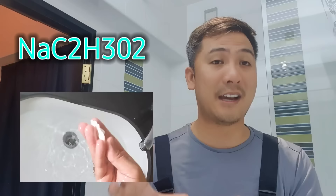So as you can see, vinegar and baking soda does not work. Sodium bicarbonate — which is baking soda — and vinegar, which is acetic acid, form something called sodium acetate. It is water soluble but it also forms these crystals inside your pipes which may worsen the clog. Go and get yourself a chemical solution, a drain declogger from the supermarket — that would work much better. But if that doesn't work, you have to open up your pipes. Click up here for that video — I'll teach you how to open your pipes and solve that. I hope you guys take care. Thanks for watching and I'll see you on the next one. Take care.